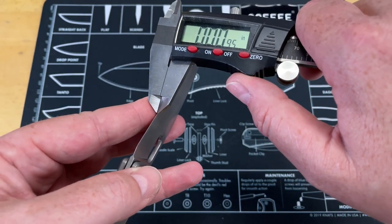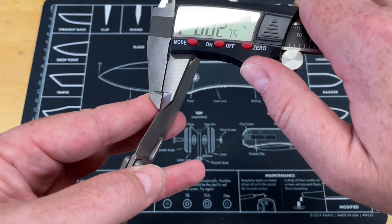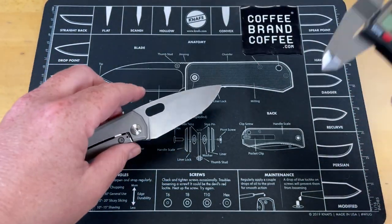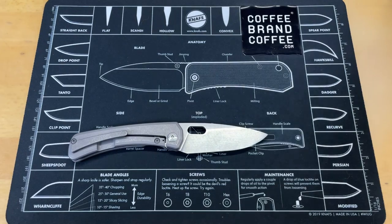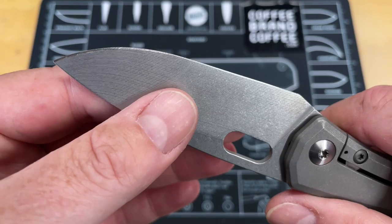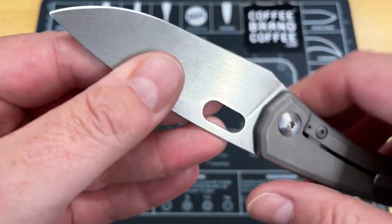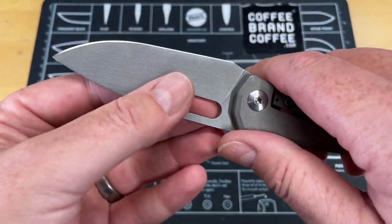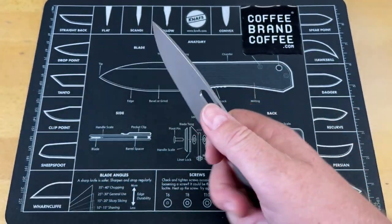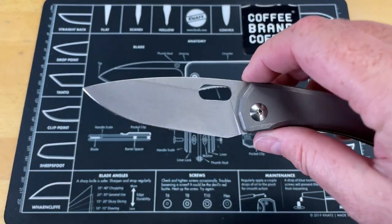I was getting thicknesses behind the edge at the middle of this blade — .015, sometimes a little bit less. I think I'm actually up on the edge grind. .015 was about what I was getting. It's hard to do on film, but I'll put what I had gotten on screen. .015 behind the edge thickness on this, and it's a flat grind, not a hollow. That means there is no scalloped-out area where it transitions really thick — this slides through material very, very well.